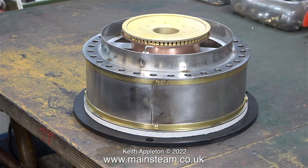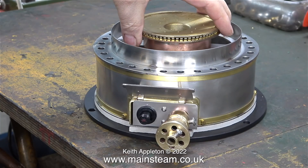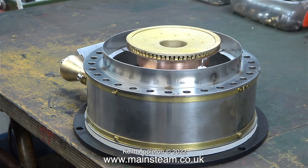This is very well designed. When I turn it round you can see that it's fitted with a gas inlet venturi and also a piezo electric igniter. The burner unit and the igniter fit into an existing ashpan. But I prefer to have two ashpans — one with a gas burner for gas firing and the other one with a grate for coal firing.